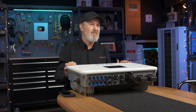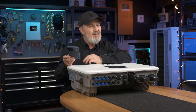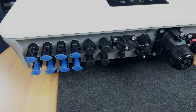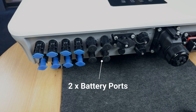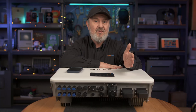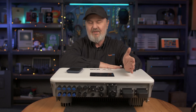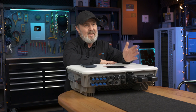What are some features that really stand out for me? First, and I hinted at this earlier, is that it's got two battery ports — two independent battery ports. You can actually have different voltages on each battery port, different state of charge, and different capacities. The ability to expand your storage is really well covered with two battery ports. Being single phase is great because most homes in Australia are single phase, and being 10 kilowatts means it can do whole home backup.